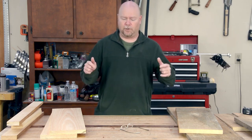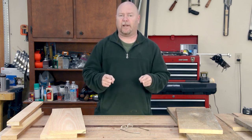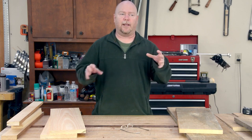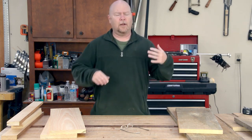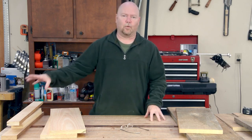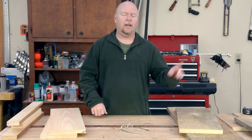Not much you can do about the bowls once you cut the hole — that's the size bowl it fits in — but the legs we can make adjustable. I still have a lot of this air-dried pine laying around and since I won't be the one maintaining the finish on this project years to come, we're going to go mostly with paint. I've got the top and the rails milled; I'm going to glue this panel up so it can dry and then go back to milling work on the leg stock.